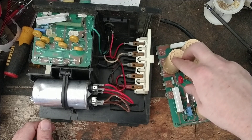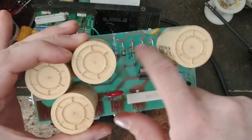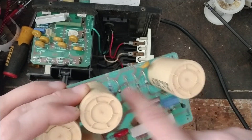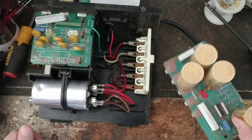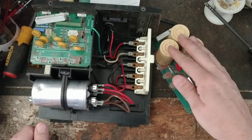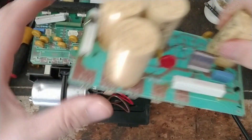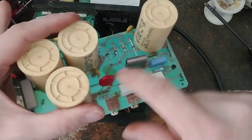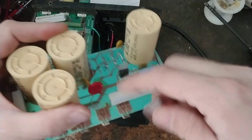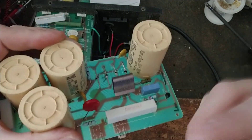It gets the charge over to these two big capacitors over here. Gallagher calls this — and probably some other brands too — a multiplier circuit. You've got four diodes, each one going in line with these capacitors electronically, there to protect the capacitors. As it builds up the charge through all these capacitors gradually, it puts it over to this stack of capacitors. There's a timing circuit that times it every second and a half give or take, and there's an SCR — they call it a thyristor — right here, with a heat sink to help with heat dissipation.